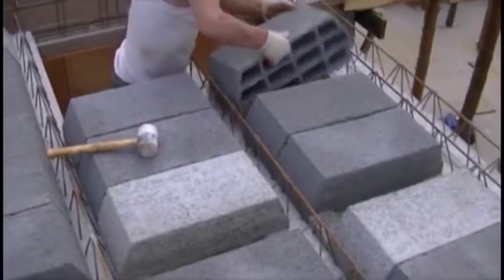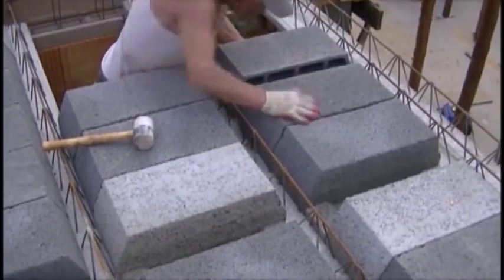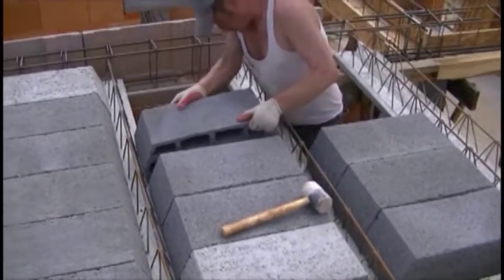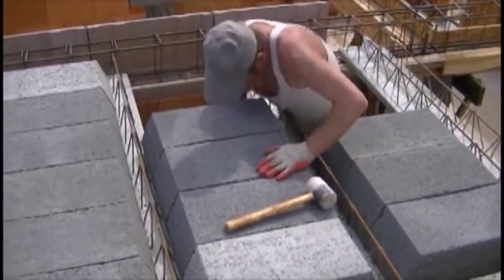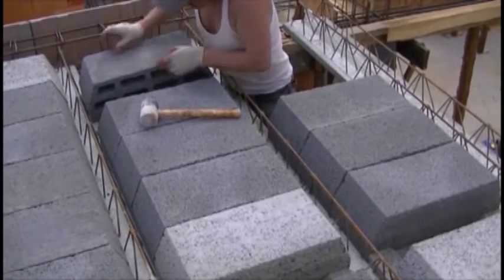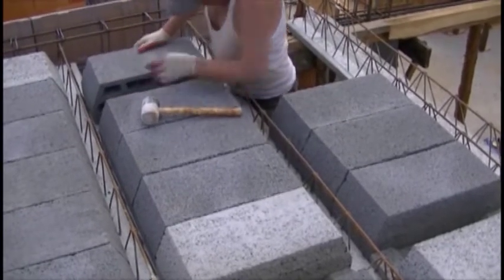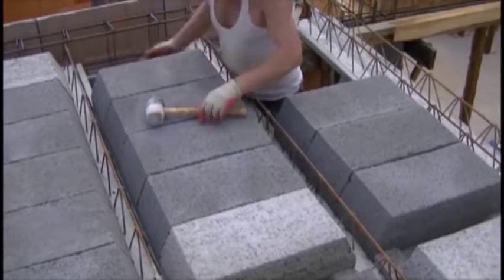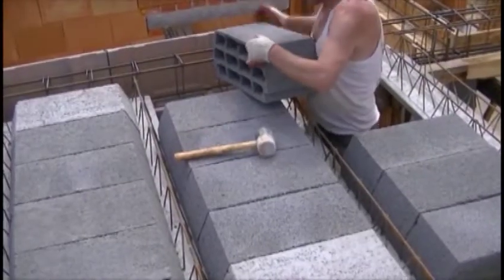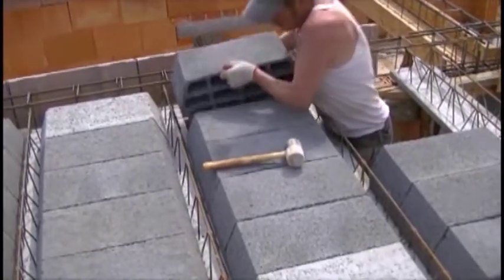Here the contractor doesn't put the spacers on the edge of the structure in the last 2 rows, and note that the last blocks barely fit in. If the ceiling were longer, it would be necessary to dismantle the last row. So, as I mentioned before, always do it right so you don't have to correct, disassemble or modify, and certainly don't leave anything for later.